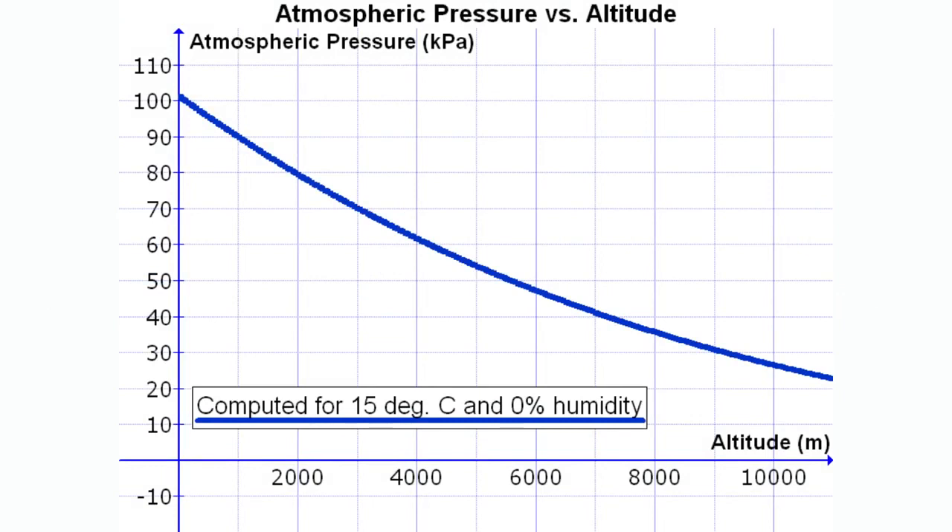So how do you do the altitude calculation? It's actually a well-known mathematical calculation. When you know the barometric pressure of two different altitudes, you can tell how far apart those two altitudes are — as you raise something up 10 meters, you can measure the barometric pressure change and use that to calculate how much you moved up and down. If you know the barometric pressure at sea level — a commonly published piece of data you can get on any weather report, like today's was 1034 hectopascals — you can then use that to calculate the sensor's absolute altitude. You do have to have that reference pressure, but especially for IoT devices that can get data from the internet, it's a commonly available number.